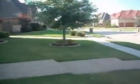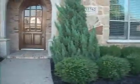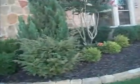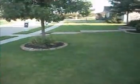Another tree here, that's sufficiently far from the house not to worry. Now these trees here are not good, they're going to grow very, very tall. I recommend that you have those removed. Likewise the crepe myrtle, you need to not allow them to grow any taller than they are now. They need to be cut back hard. Again, they'll grow very tall, turn into a very large tree, and of course they put out large roots, and it's roots that actually lead to foundation issues. So the grade at the front, apart from the trees, good.